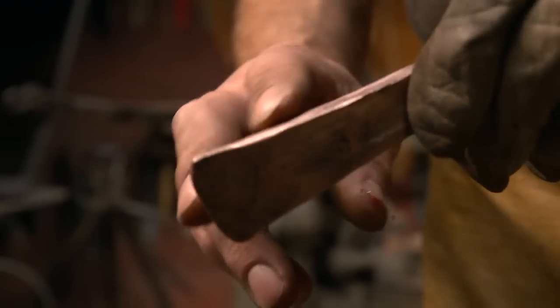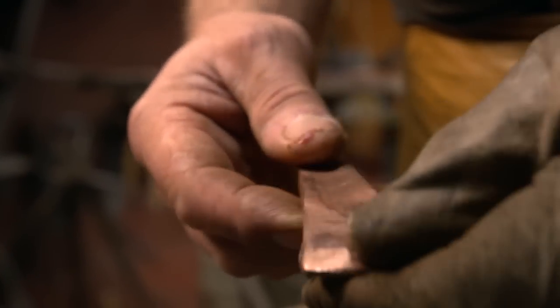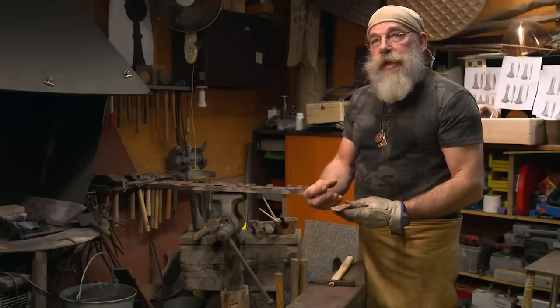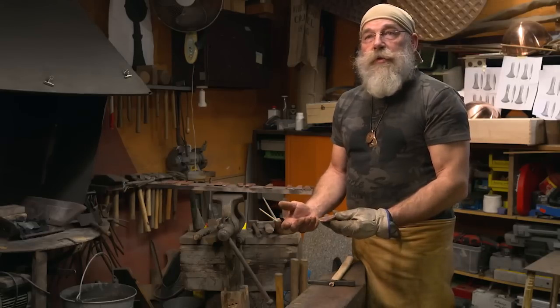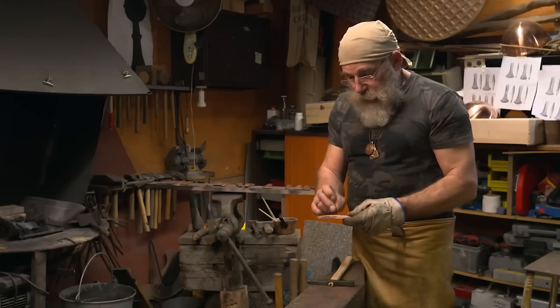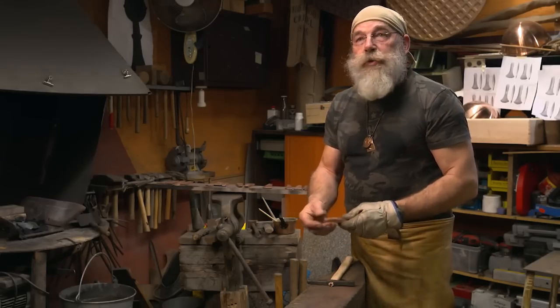I thought with a big hammer you can move more material, but it was not so. The material is also very porous, and if I work with the big hammer over a large surface, these porous pieces break very simply. That's what I noticed with different pieces. And that's why I decided for a small hammer, which works punktually very well, and it comes to almost no more crack formation.